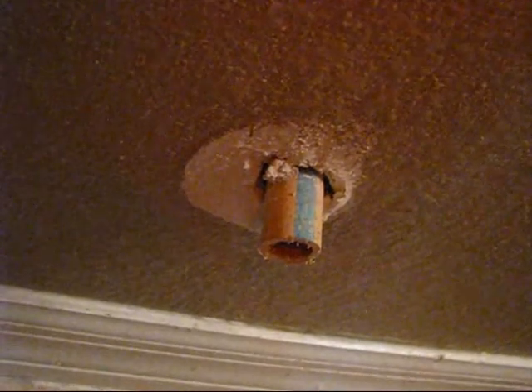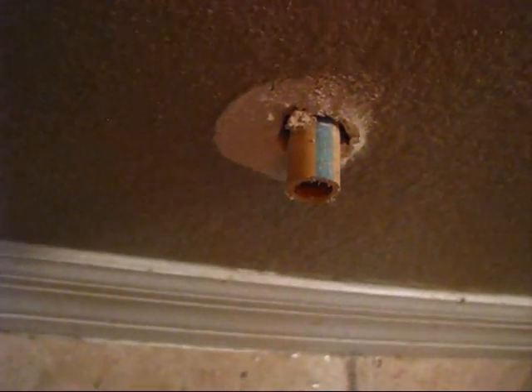Using the flat screwdriver, remove the ring. Little by little. The ring is removed and we exposed the pipe. This is how it looks. It's ready for the new valve to be installed.